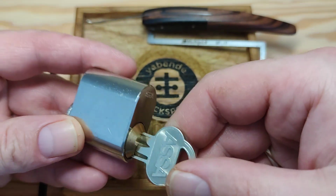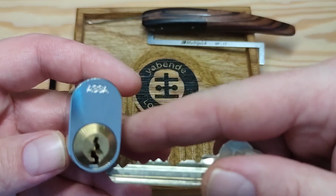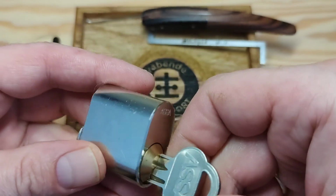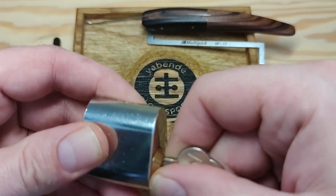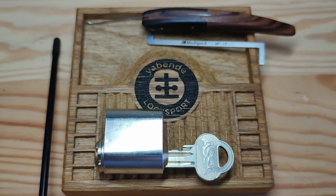Today I will show you another version of the legendary lock, that is the Assa 700, this time with tapered pins. There are 7 pins in the lock and there are no additional security and locking system besides them. We will see the internals after picking in both directions. Then I will do some gutting and see what's inside the lock.